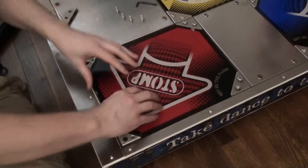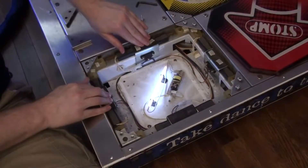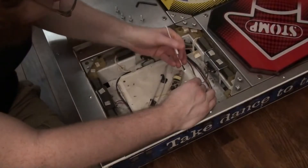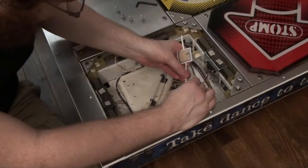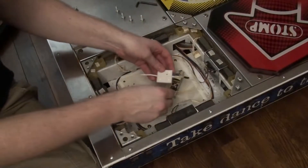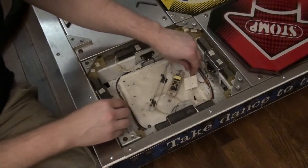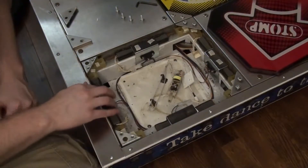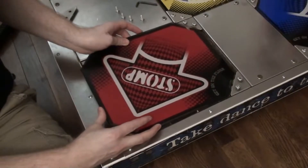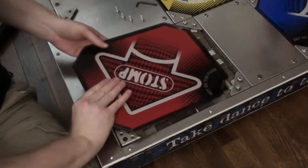The machine is on in IO test mode — I'm showing what it looked like with the tube, how dim it was. It lights up but doesn't do the best job. That little connector I just disconnected is what connects to those headers. I used calipers to measure the pitch distance between the two pins and found headers on Digikey.com with the appropriate pitch — ordered the right number and they did work. You can see just how bright the LED modules are — that's vaguely what the panel will look like when it's all together.